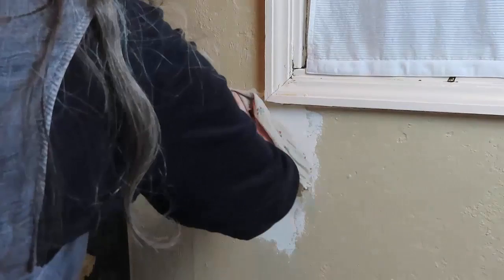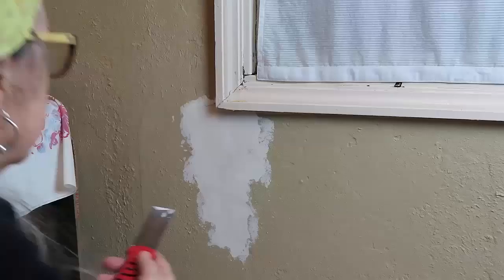Now that it's sanded, I'm going to dust it with a rag that's just barely damp. My camera enabled me to get up under here and finally get a good look. Right where the seam is, where the window frame meets the wall, you can see there's some marked deterioration where the whole area has gotten wet. I'm going to dig in there, sand it, and hit it with some high quality caulking before I'm finished with everything else.